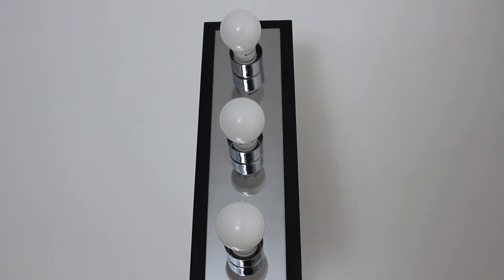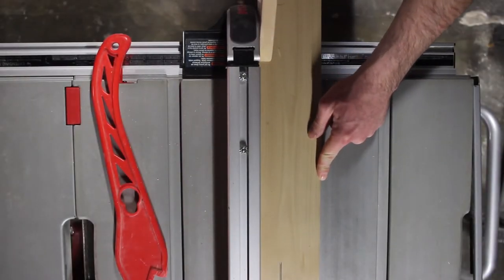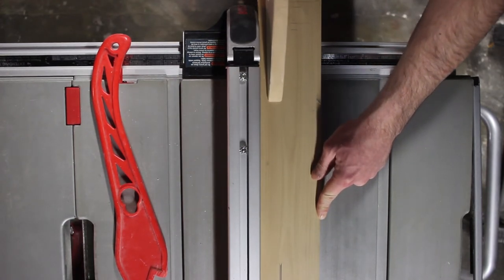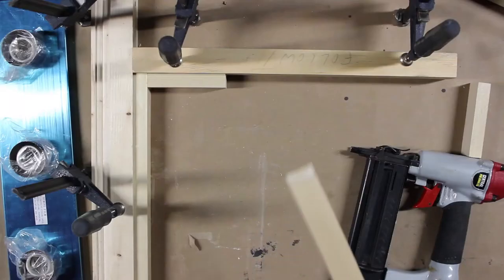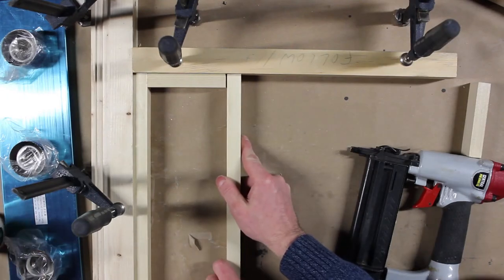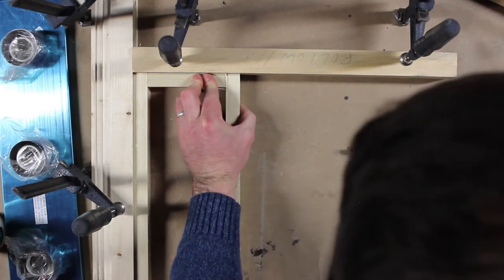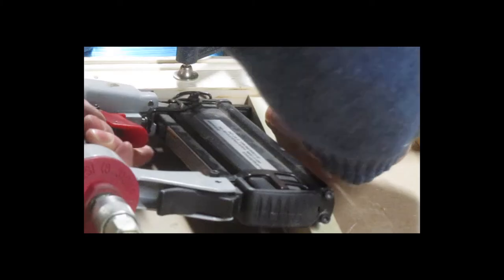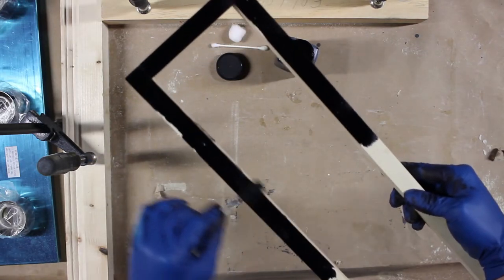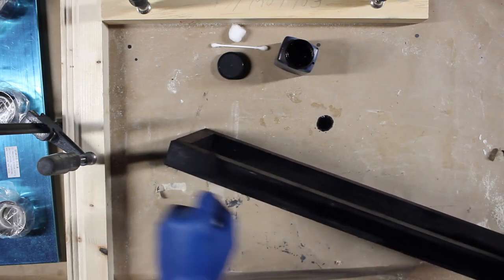Let's take a look at the overall construction of the lights. The frame is made from some scrap poplar boards I had laying around, ripped down on the table saw to an inch and three eighths and then cut to length. This project calls for utility grade construction, so I used my trusty finishing nailer and some wood glue to assemble the frame. I used some Fiebing's black leather dye to give it a bit more of a finished look. This turned out fantastic and dried very quickly, so I'll definitely be using it on future projects.